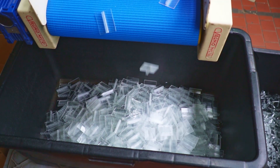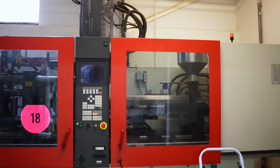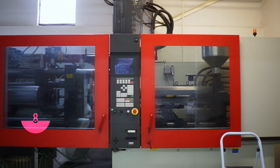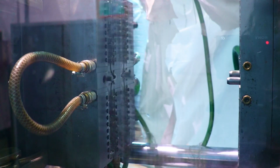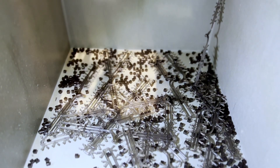The hot liquid plastic is then injected inside an iron mold of the shape we want to create, and it needs about 20 seconds to cool down inside the mold so it hardens. Then pins push out the cubes from the connection tubes of the mold — you see them popping out — and the next batch follows soon after.